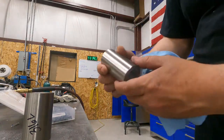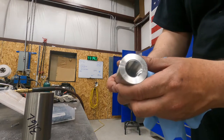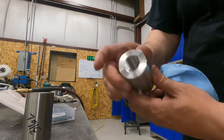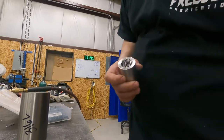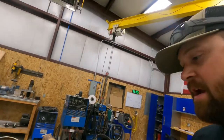Okay, so there's our part. One inch, 14 TPI on the one side. Inch and a quarter, 10 TPI on the other. Both are left-hand thread. I think I'm going to go to bed because it's 11:14. Then we'll see if we can't knock out the shaft tomorrow.